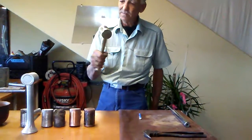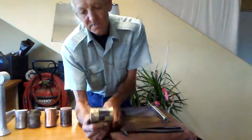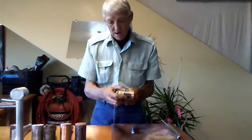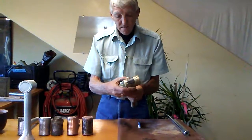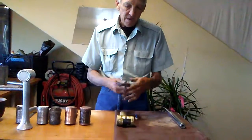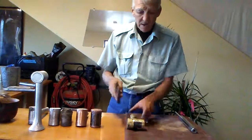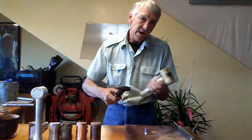Pretty good hammer. You'll see right here up close where part of the tin can is still on there. I feel that the flux — borax — probably welded the can to the hammer itself and I could not get it peeled off. After you do your pour, in order to get that can off your hammer, I found the best tool to use is the fencing plier tool, where you can peel that can right off of your hammer.